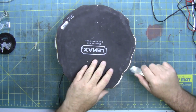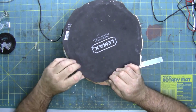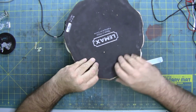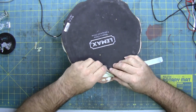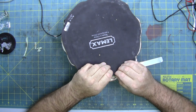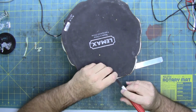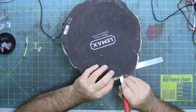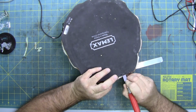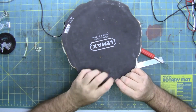This is generally the longest part of doing this, is trying to get in without destroying the mat too much. Yeah, it sounds like it's being broken. I'm just breaking all the glue, not breaking the unit. So I've been using a spudger. I'm going to use a flat scraper blade on an X-Acto because some of this mat has re-adhered really strong in some spots. Some more of this hot glue out.